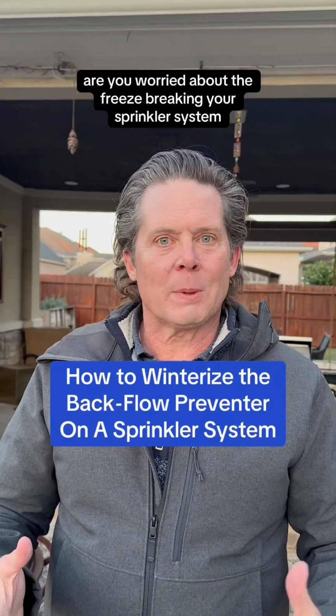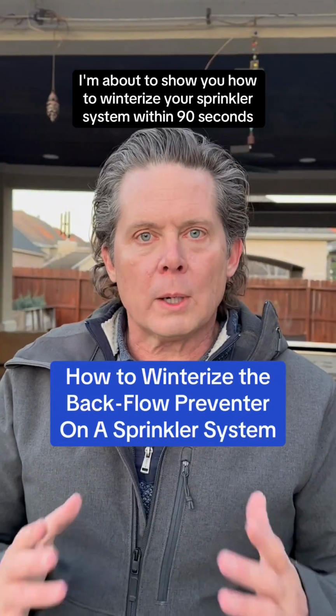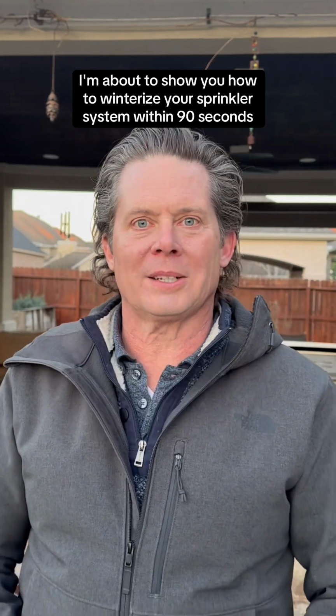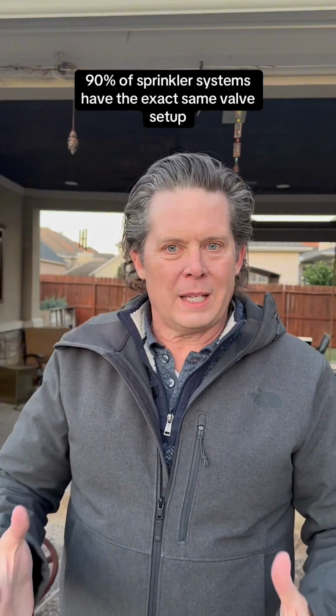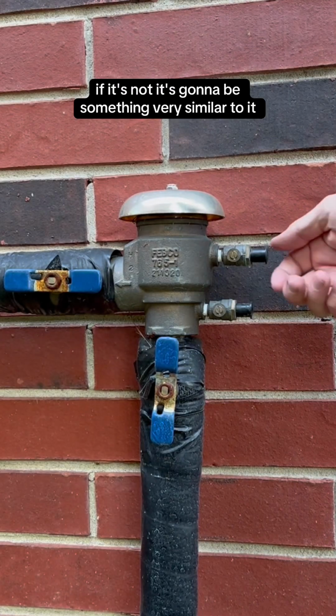Are you worried about the freeze breaking your sprinkler system? Don't worry about it because I got you covered. I'm about to show you how to winterize your sprinkler system within 90 seconds. 90% of sprinkler systems have the exact same valve setup. It's usually a Febco 765. If it's not, it's going to be something very similar to it.